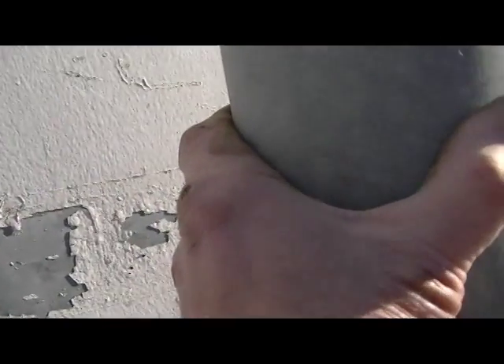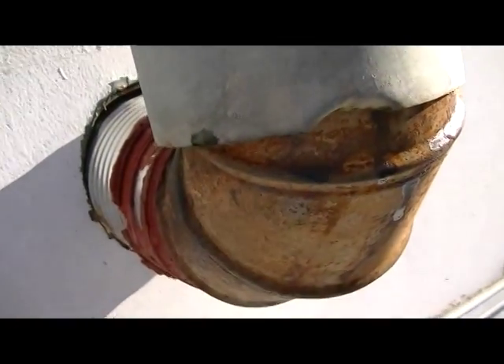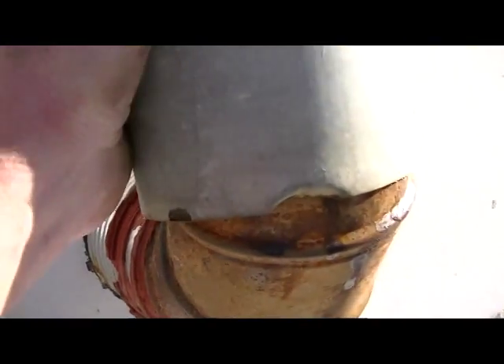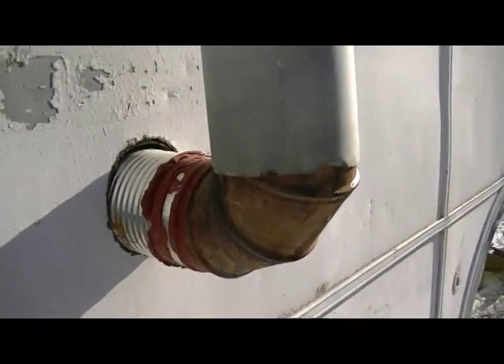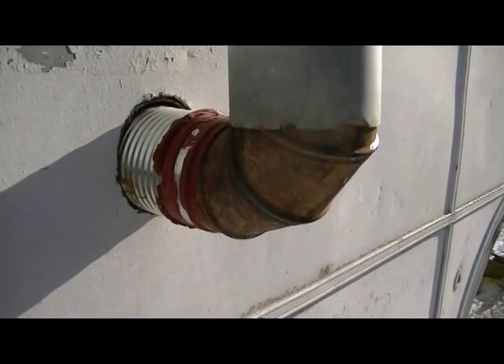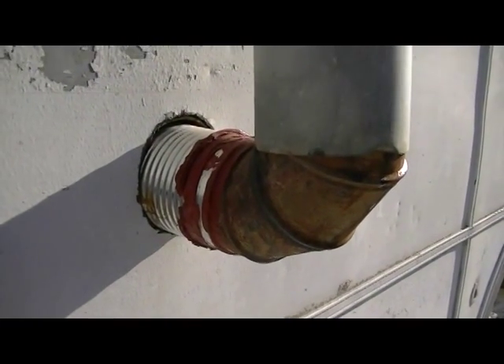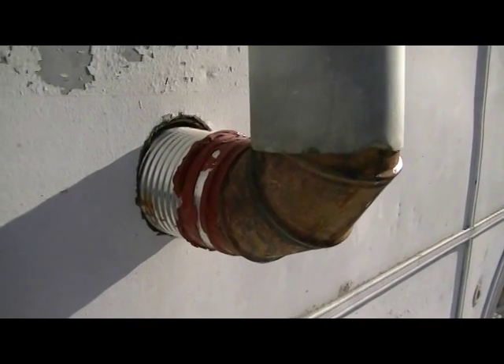You can see the ripples of heat going out the top — no smoke. This pipe is cool enough that I can have my hand on it, no problem. Right past the end of the stove, I've already lost the heat into my shop. If your stove is burning at best efficiency, your chimney will be almost too cold to draw a draft.